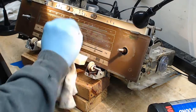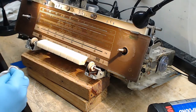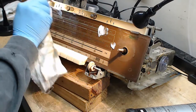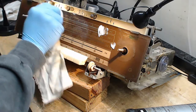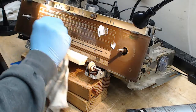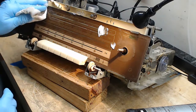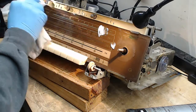You don't have to make a career of this — just get it to look good, and polish it until it starts to dry and shine. You'll find little places where deposits aren't quite clean, so work a little more on those areas. It's not fun to get polishing compound out of cracks. If you were to remove the dial face, there'd be nothing to polish on the back side because it's clear plastic that's been painted on the back — all that brown is paint, and polishing it wouldn't be visible from the front.